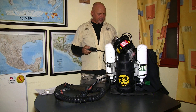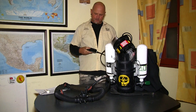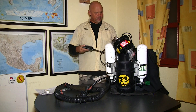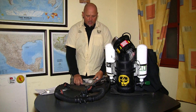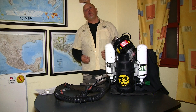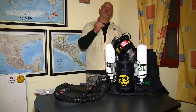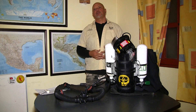I have 48, 48, 48 — I'm now going to calibrate. Confirming. Alright, the unit is now calibrated. My electronics know what is oxygen and what is air, and with that knowledge the electronics will know, predict, and display what the oxygen content is inside the loop.